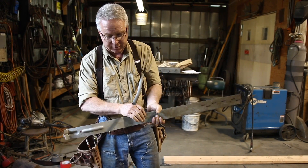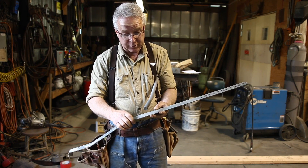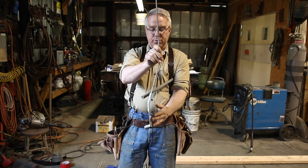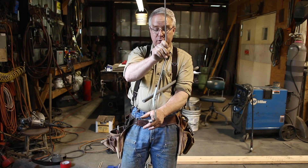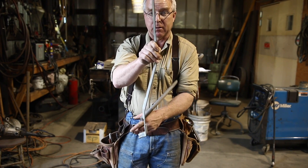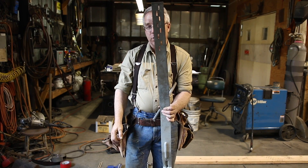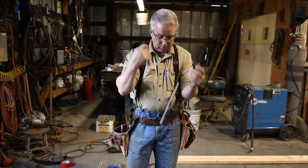This was the next serious kind of step towards seismic awareness for residential. This is called a Simpson fast tie. You may be able to visualize that it would attach to the edge of a wall form, and then the offset puts this hook down into the middle of the wall. A piece of rebar — a longitudinal bar — could be laid on that hook, and you can see that would put a great deal of resistance to draw-out in one particular place. With nails or structural screws going through these slots into a stud, perhaps a 4x4, whatever is called out to get the resistance to uplift — pretty good.